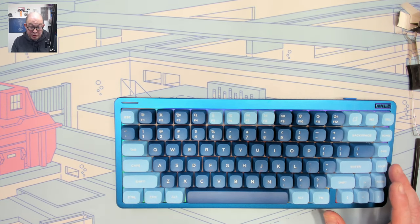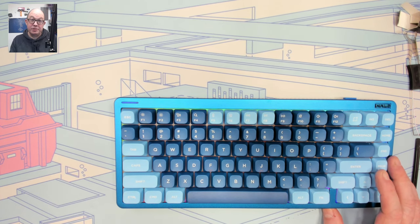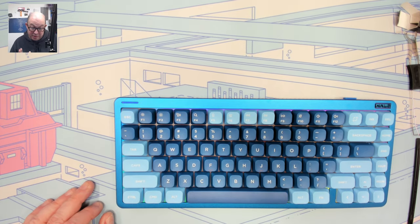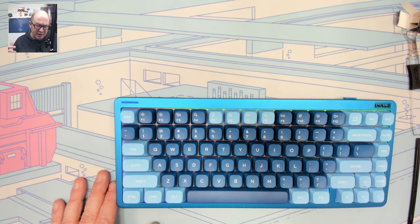Now this lemon switch, it's all right, but I prefer a nice heavy tactile, heavy as in a very pronounced tactile bump, and heavy also as in the spring weight. The spring weight on this is, I'm going to say 40 grams, 42 at the most. But it sounds pretty good. So I'm curious what it's going to sound like when I come back to it. And I'll probably try out some Gazzew U4Ts or there's a couple of other tactiles that I've been having fun with lately, like the Gateron EF Grayish. I don't know why I always want to call it something else, but the EF line. I still haven't tried the Curry, but that's the linear, but the EF Grayish tactile.